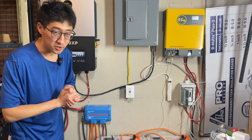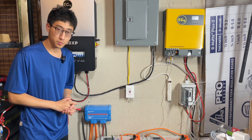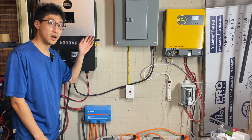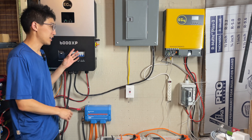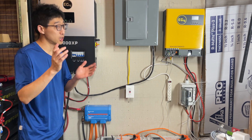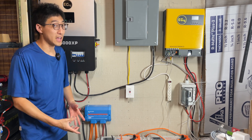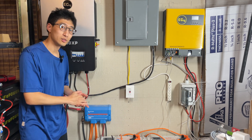So that's how you set up battery communications with AO Lithium server rack batteries and the EG4 6000 XP. This inverter is made by Lux Power and branded for EG4 — I'm assuming other rebrands of this Lux Power inverter will probably work the same way with the AO Lithium battery packs. I hope this video helps — I know I've been getting a lot of questions about whether this works.